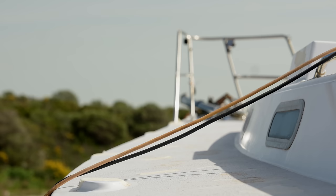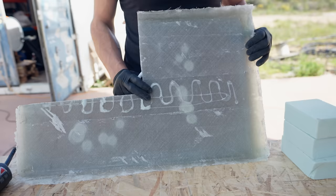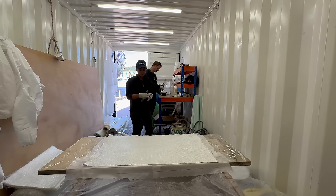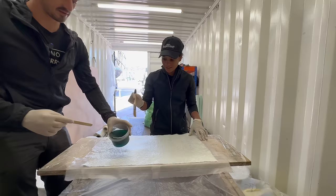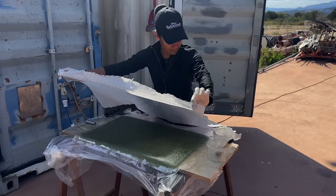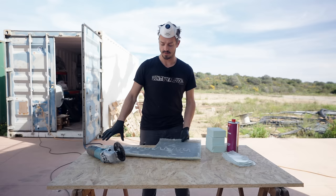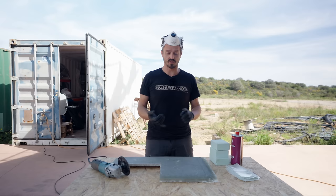The first variable where it could have gone wrong: this test piece was technically the bottom. We put plywood, saran wrap, and then peel ply on it, then started laying up our layers, then put peel ply over the top. Everybody we talked to said you take the peel ply off and laminate right over it — it's a nice clean surface ready to go. But because we flipped it over, since it was flatter, and laminated on this side, there may have been some weird chemical vapor wax issue. So we're going to flip it and bond directly to the other side.